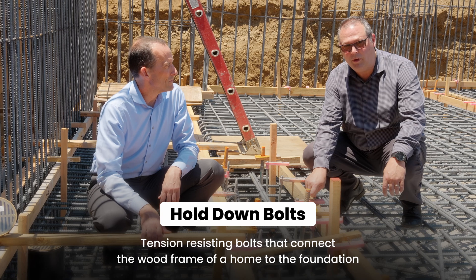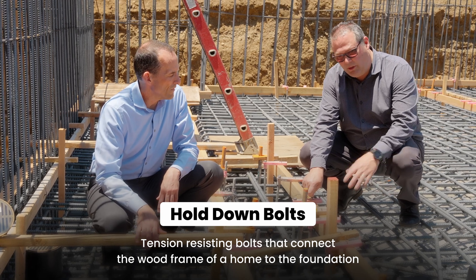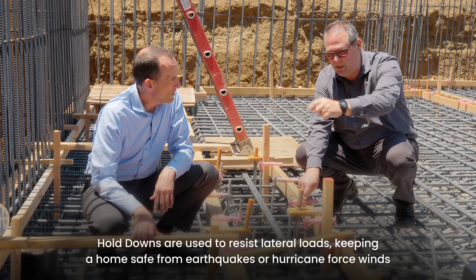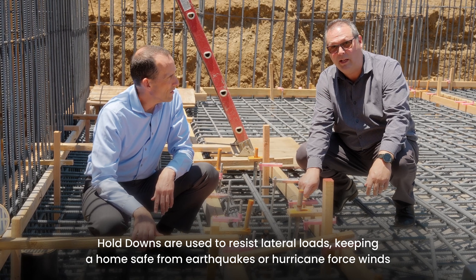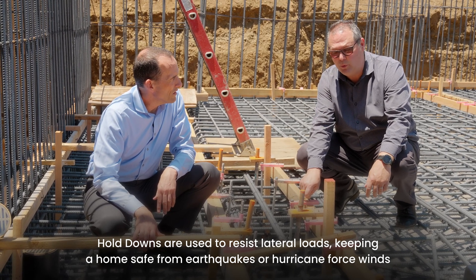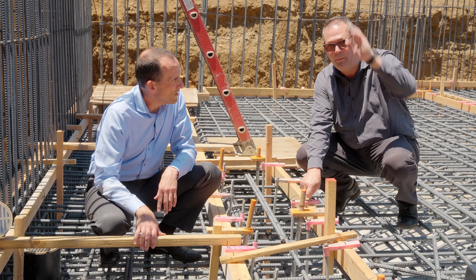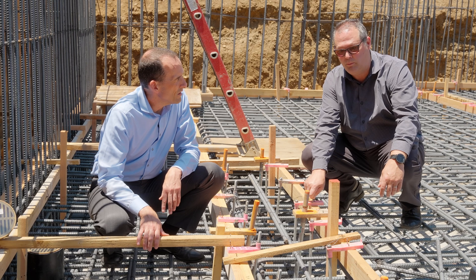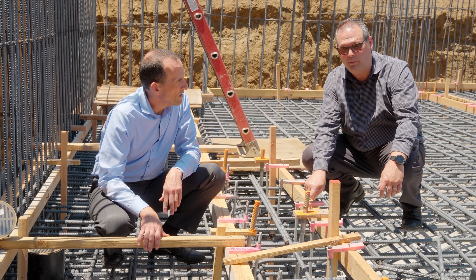So this is the exterior of a house and you don't have any wall continuously along here — it jumps over six feet to the next wall. So this has to be a shear wall. It has to be very strong. This originally had steel I-beams on top. The floor-to-floor connection was a welded connection. It was a very strenuously built wall.